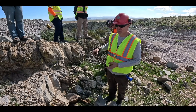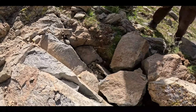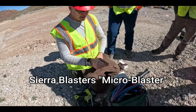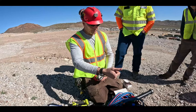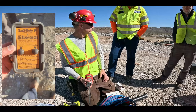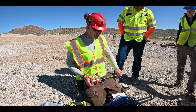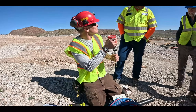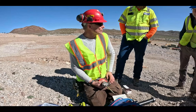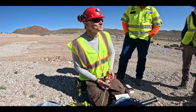Sometimes you can make a little clay plug - it helps it stay really stemmed in. And it did the business. It's like a partially buried cartridge. We could have probably taken that burden back a little farther and it probably still would have worked. These are nice and heavy - it basically holds the cartridge on the end, you stab it on the end, and the wires get threaded through here. Then you hook it up to a generator or a blasting machine. Easy as anything. You just get back about 20 feet to pop it. The key to this thing working is you need to clean the hole really well, otherwise it gets jammed up. But it'll blow up a couple of cubic feet of rock. If you need to trim something laser precise - for cave rescue, this is the hot ticket. You can blow up a rock underneath a guy's leg without hurting him.